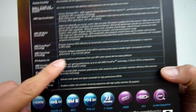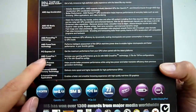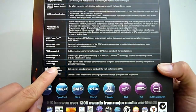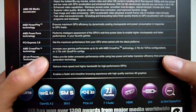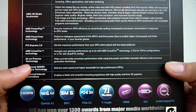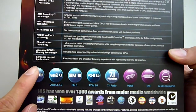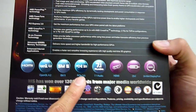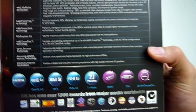PCI Express 3.0 slot as mentioned before. CrossfireX for combining more graphics cards and increasing performance — note the 7800 series cards only have one Crossfire header so only a maximum of two can be used together. The GDDR5 VRAM as mentioned before. Support for OpenGL 4.2, Shader Model 5, and finally the card has one HDMI, one DVI, and two mini DisplayPort connectors.